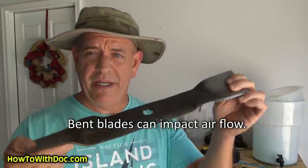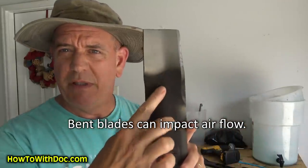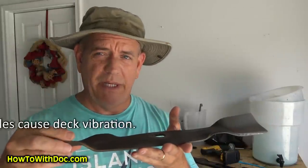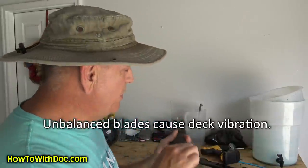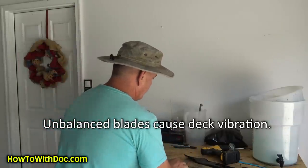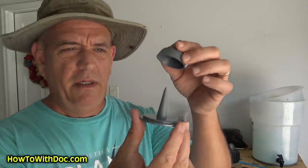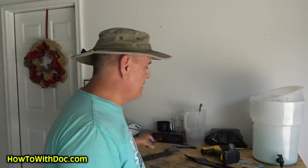Because you're out in the heat of the day running this thing a lot, hitting rocks and twigs, you can also get blade damage. The blade can actually warp, get damaged, and there's buildup on it. Balancing of the blade is important too. This kit comes with a little balancing tool - you just put that on there and use it to balance your blade. You also want your blades balanced; again, you're spinning 3,000 RPM.